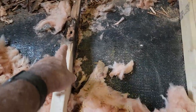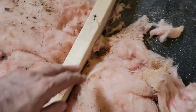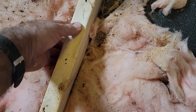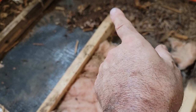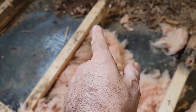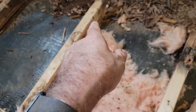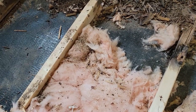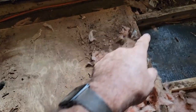This is a rotten part right up above there, so this has got to go. I'm going to have to come back here so I have a support, because you don't want to have a joint in between — there's nothing to support that joint. This one's the same way — I can just cut the bad part off and then make a joint on one side of it, a good supportive joint, so both boards are supported by that seam. Instead of just a butt joint, I'll need one where they kind of interlock. And this one is bad clear back to here, so this is going to be a long piece.